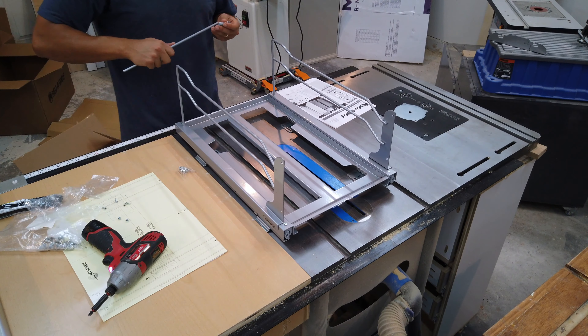So the next thing I do is put a little bit of tape on the face frame once it's ready to go. I lay the door on top like that. I get my spacing on all sides, then I clamp it down, push the rails forward so that they make contact with the face frame, screw it in from the back, and I'm done.